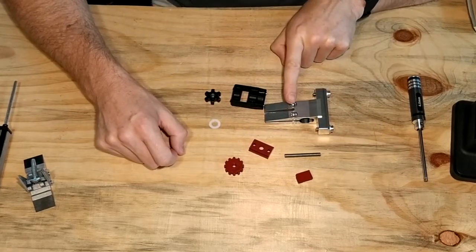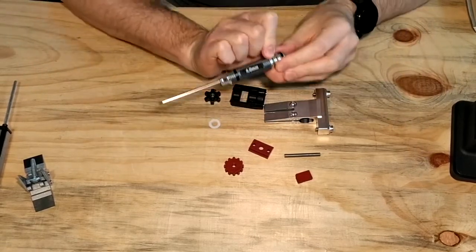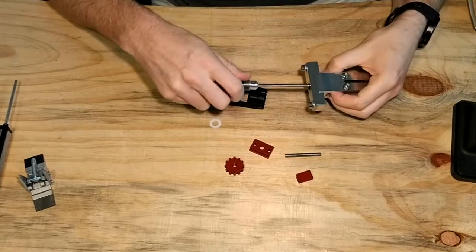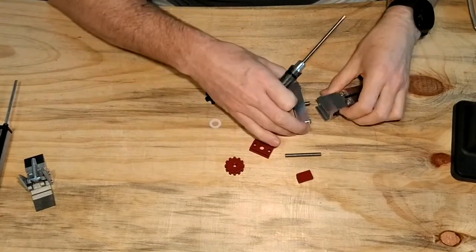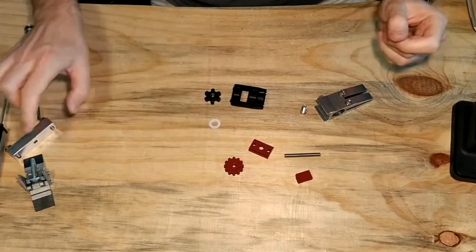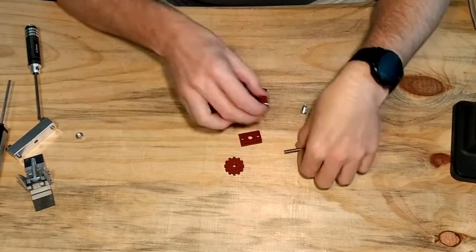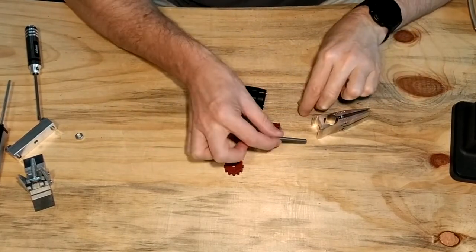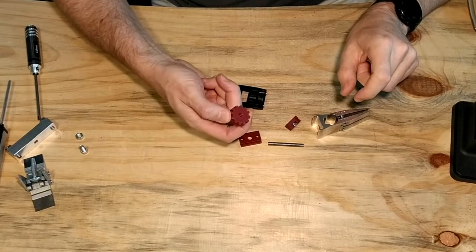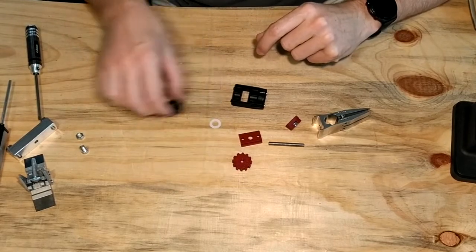So firstly, if you receive the KakBritva clamp with the KakBritva holder in the back, we'll just have to remove that. With a 4mm hex driver, easily remove the back part. I'll put aside the adapter for the KakBritva system. Now, we'll be using the new threaded bar, the new nut supplied, spacer, and also a new thumb screw provided, M6 size, provided by Gritomatic.